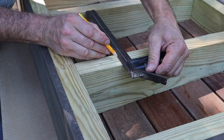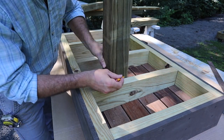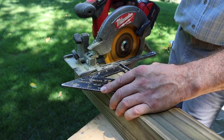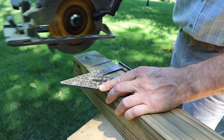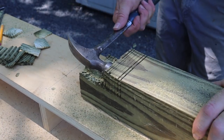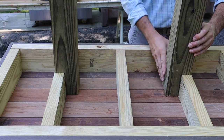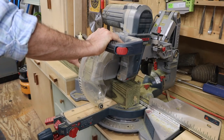I'm attaching the post six inches from the work side of the table. I've already cut a four-degree angle at the top of the four-by-four post. Now I'll make a mark where I'll need to cut an inch and a half deep lap joint. I'll cut the post to length, then cut another lap joint at the bottom of the post where the post and table will be attached to the dock.